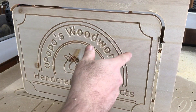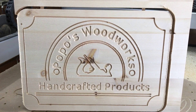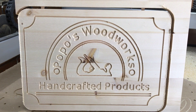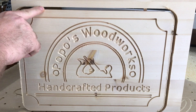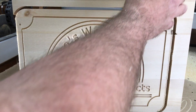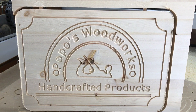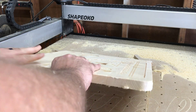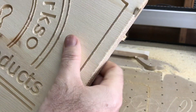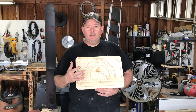As you can see, I did the tabs so the piece stays in when it's cut. I had a few hiccups: I accidentally cleared the zero axis when I changed to the 60-degree V-bit, so I had to do that the hard way. Then when I went to cut the outline, I had only set it to go down a quarter of an inch in the program — I forgot to set the depth to go all the way through the wood — so I had to redo the program, re-upload it, and that's why you see it cut the outline twice. Now I just pop these tabs loose since I made them thin, then take a sander and knock off those tab marks.